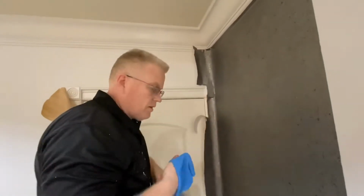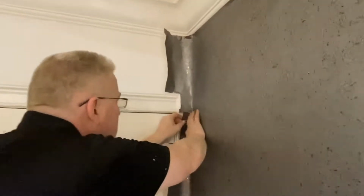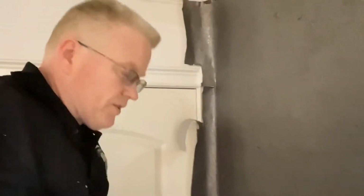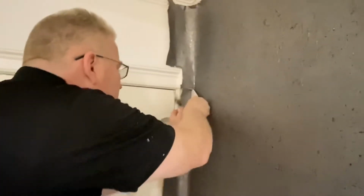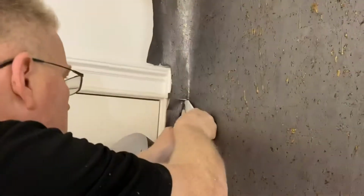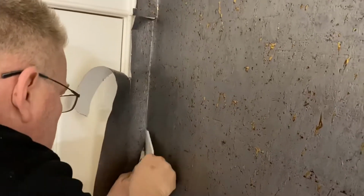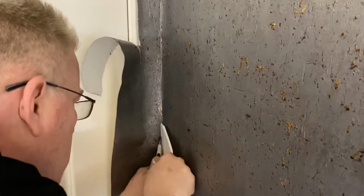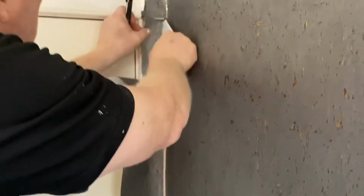Now, a couple of tips and tricks regarding cork. You have to have scissors because you can easily tear cork if you should use a regular knife for cutting your cuts, like the one I have in my hand. And so what you see me doing is using a plastic 8-inch smoother or spatula, pressing firmly up against the woodwork around that door in order to make my cut.